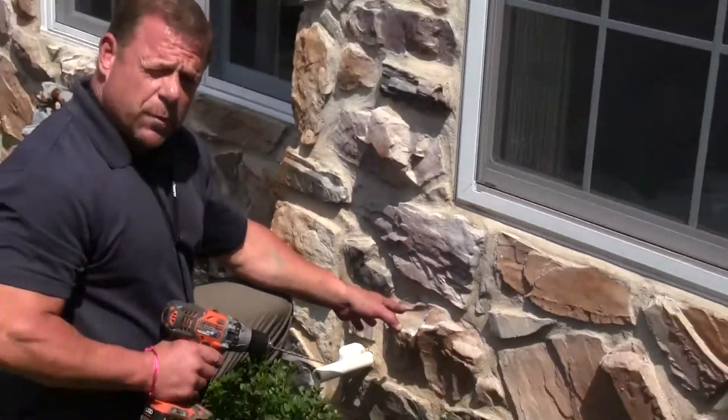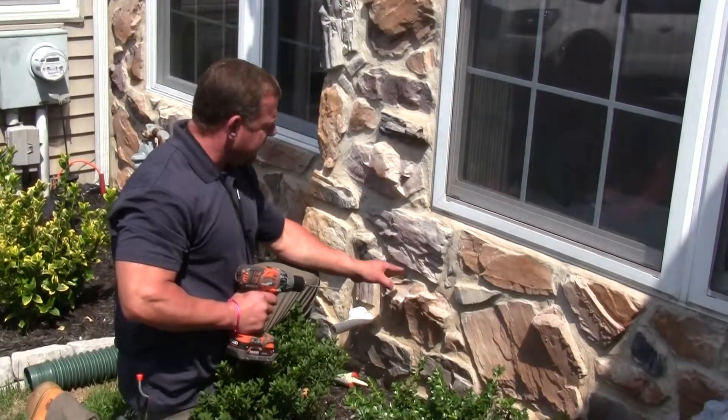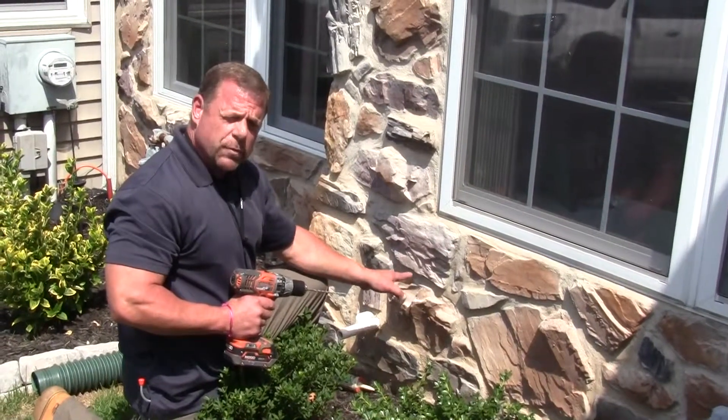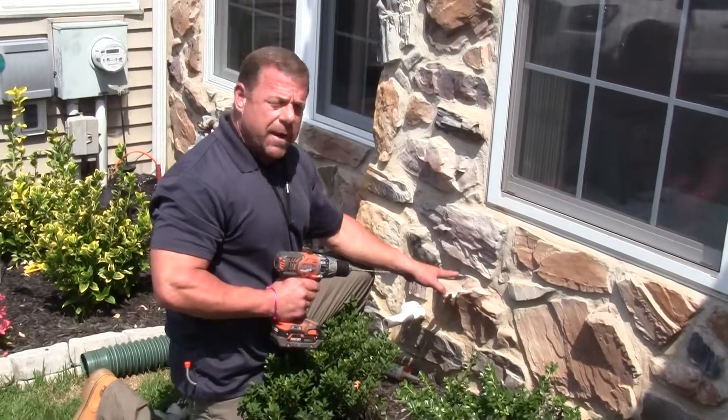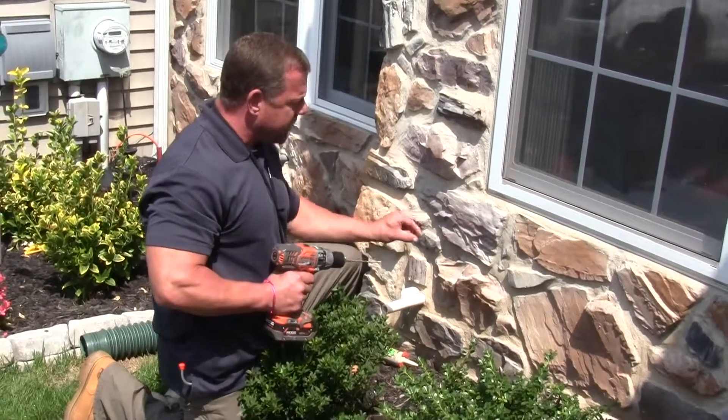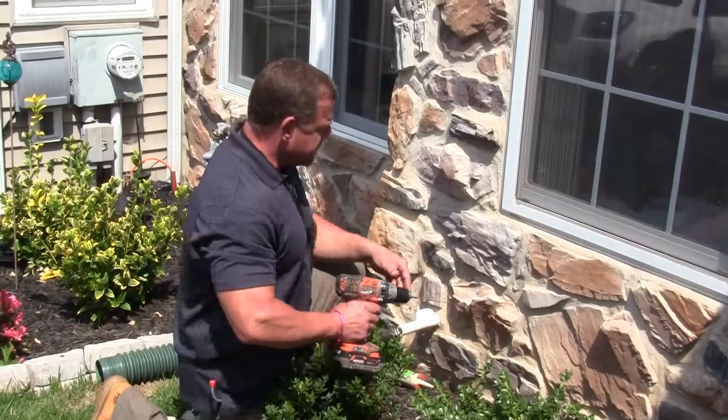You really have to be very careful when you're drilling these holes. You have to be able to kind of feel the substrate when you get through the mortar or the stucco, to make sure you don't go too far into a framing member. We really want to take our moisture readings from just into the substrate.